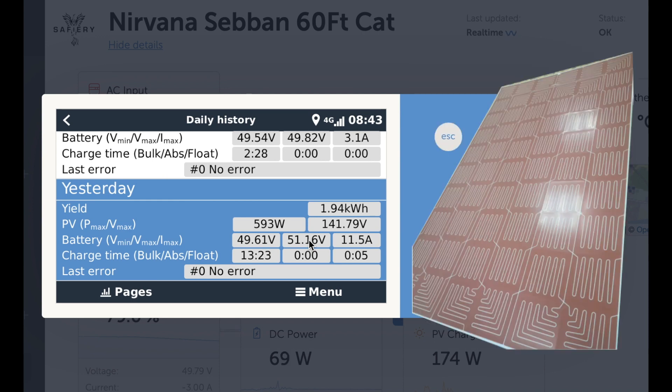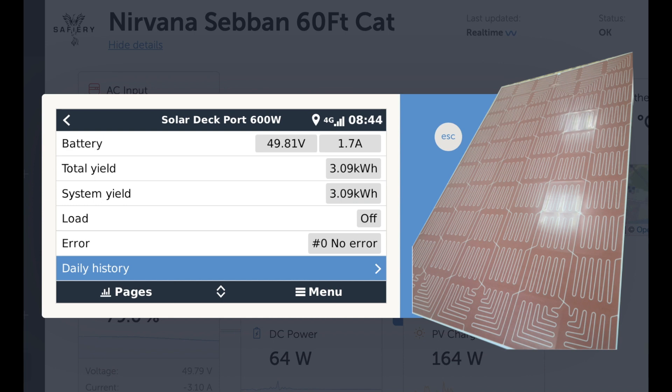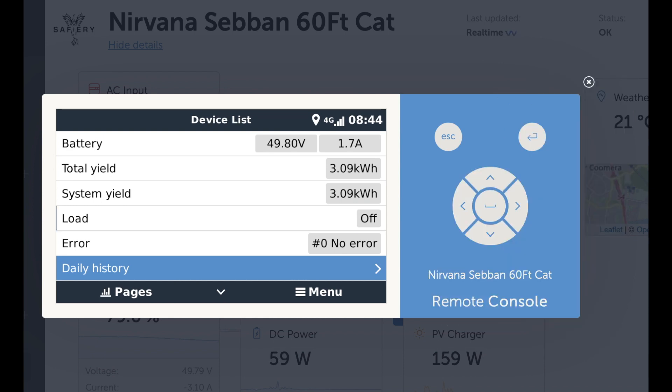Overall, the copper flex is bonded straight down onto the deck. It has a copper sheet on the back that takes the heat out. It's only 1.7 millimeters thick — the previous ones we had were three millimeters. Going thinner is a bit counter-intuitive; you'd think that would make it weaker. But the copper sheet in there actually makes it stronger, so I've gone for a more flexible sheet.